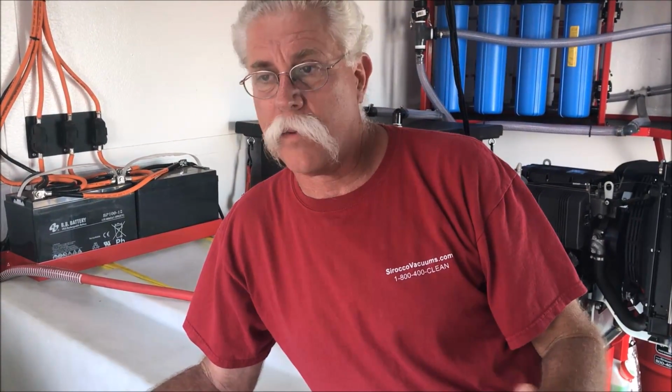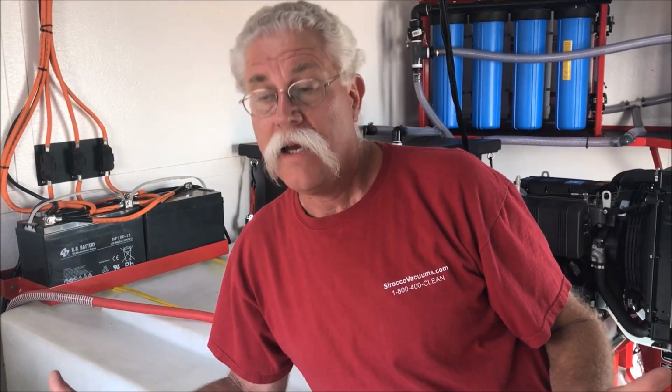Wouldn't it be nice to be able to turn the system down so you've got 7 gallons a minute going to one 21-inch surface cleaner for doing a demonstration for a new client with the engine running at half speed? The thing's going to be super quiet. Quieter is better when you're doing a demo for somebody that you want to get a lot of contracts out of. So this is one of the ways of doing it.